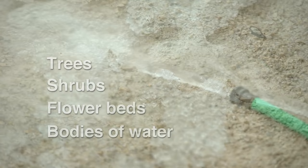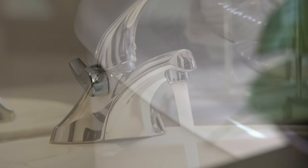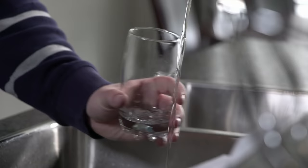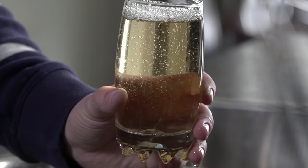When you can no longer smell chlorinated water coming from your hose, turn off the hose and flush your plumbing lines by running each faucet and flushing your toilets until the chlorine smell completely disappears. Then turn off your faucets and turn power back on to your water heater. After disinfecting your well, your water may appear dirty or darker than usual — this should clear in a few days.